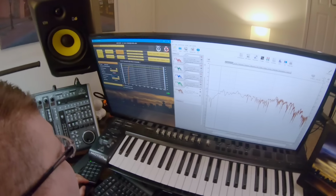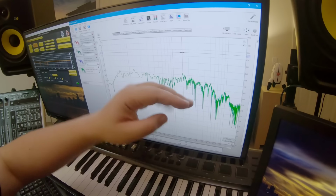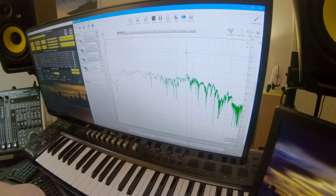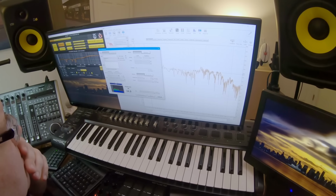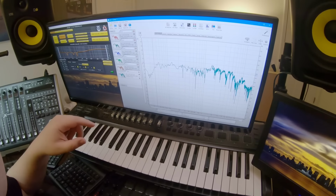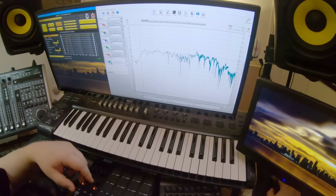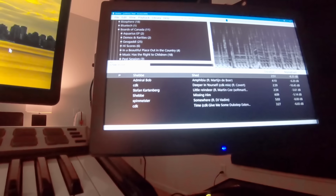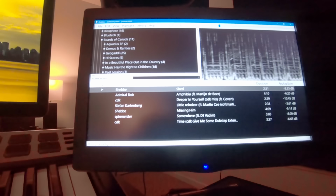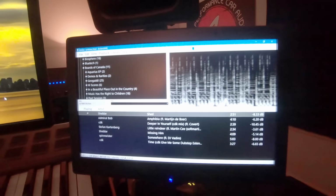But now let's introduce a DSP just before the amp, create a high-pass filter around 35Hz, work out some of the peaks, and raise the upper shelf to compensate for the fact that this is a subwoofer. What we end up with is a bandwidth of around 40Hz to 3kHz, which still doesn't eliminate the need for a tweeter, but at this point it's just sheer entertainment, pushing the limits and so forth. I'll play a few more bars of the same track and follow that up with some other royalty-free music just to bounce around the spectrum a bit. Here we go!